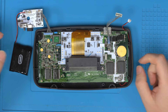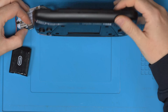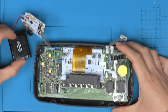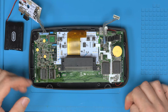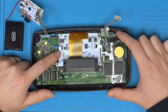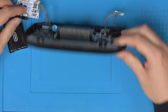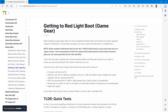It's been a while since I've done a video on Game Gears. This one specifically does not red light boot — you can see there's no red light when we turn it on. The guys have had a look at this already and can't get it working. I've done a bit more work on the wiki on the red light boot section since the last video. We've disconnected the screen and audio — there's literally no red light so we're focusing purely on red light boot.